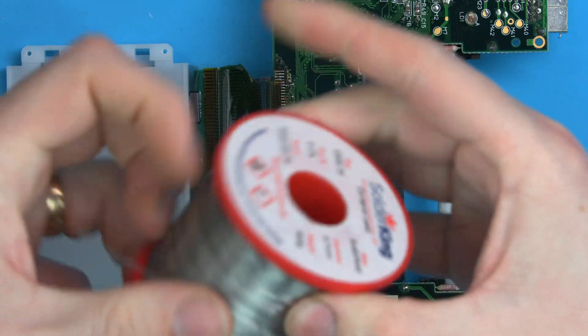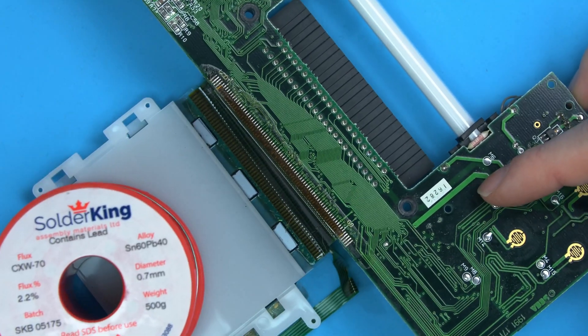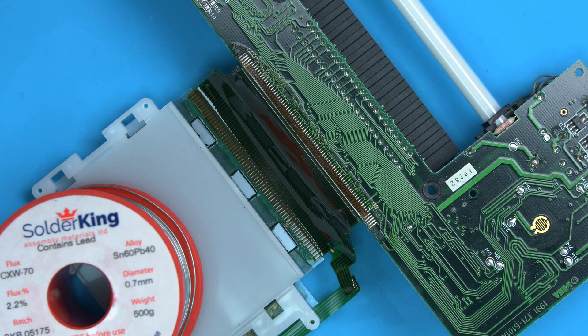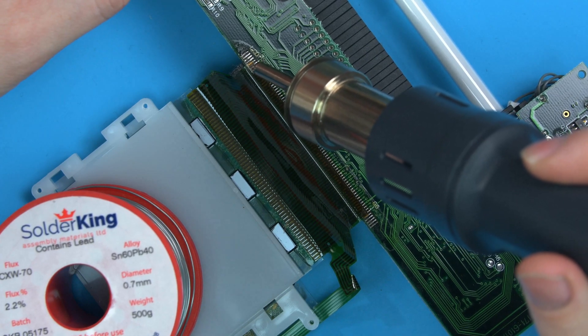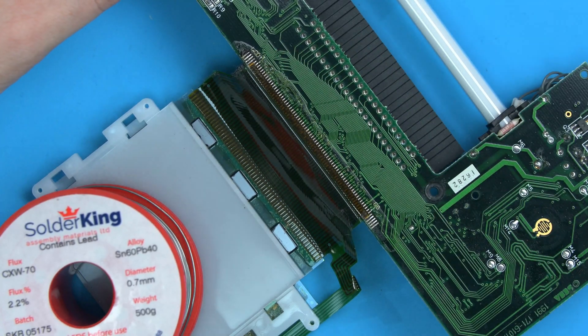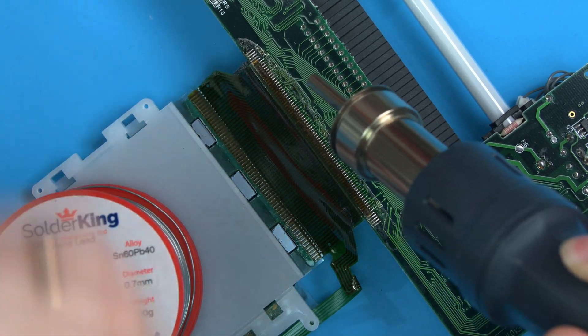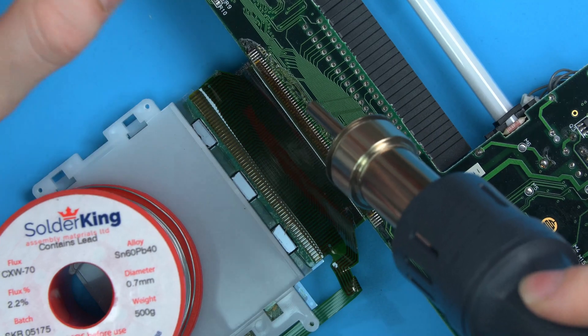You could just place a bit of solder on the screen and push from here — we'll do that in this case. I'm going to use my hot air station set to 420 Celsius and 120 air. This is quite hot, but if you use it correctly and you're fast, this is how you can take pretty much anything off. I'm going to come in close to the pin — about a centimetre away — and start on these pins. I'll wait until I hear or see this little bit click up. The first part will take a bit longer to heat up because the whole board has to heat up, and then once it starts clicking away I'll just slowly move down — click, click, click all the way down until it's off.